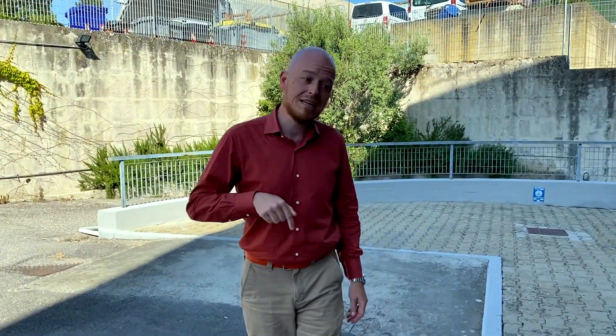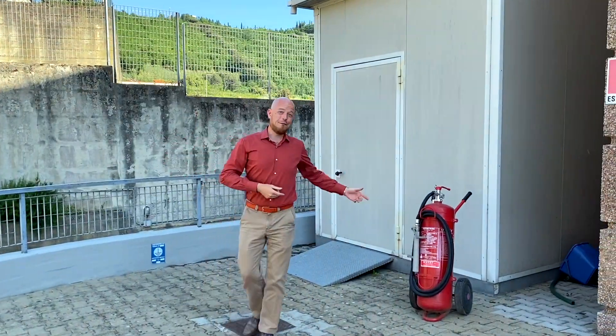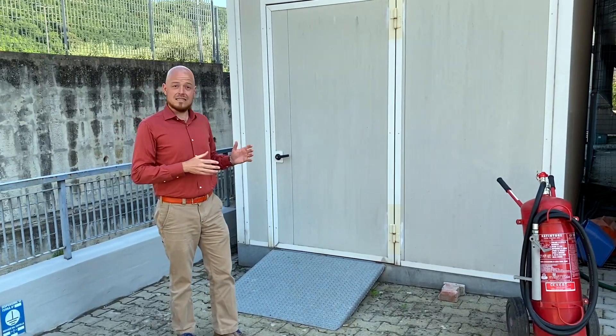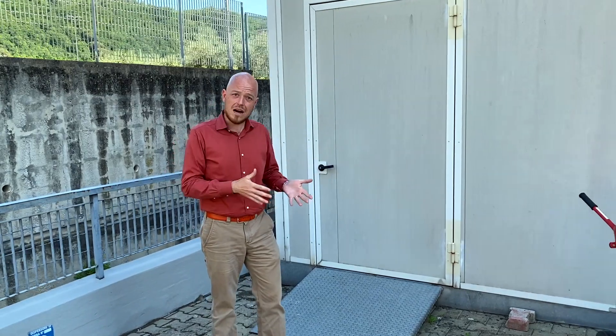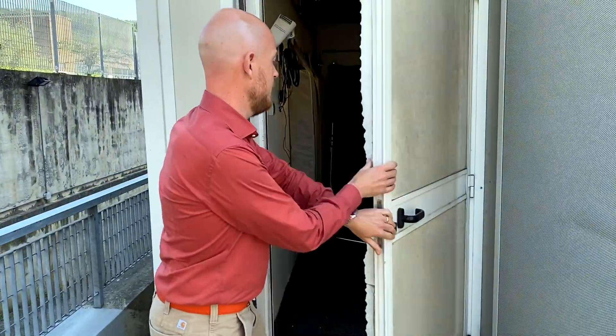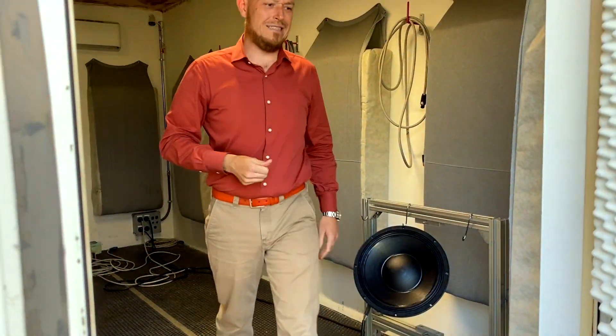Before I leave you, I wanted to show you how we do a real AES two-hour power test at BNC Speakers R&D headquarters in Florence, Italy. We do it in this bunker, which is double soundproofed and more importantly fireproof — if you've lit a loudspeaker on fire before, you don't want to do it again. The test is done in free air, meaning it's not inside a box — it's the best case for power, with lots of cone motion to pump air around the coil, and the worst case for excursion because there's no box to limit it. So the power number is quite high. It's a long test and we mostly use it for spec sheets.